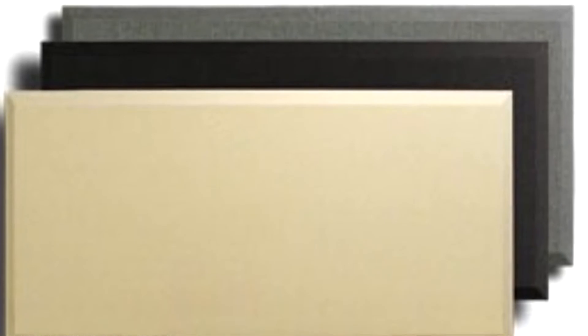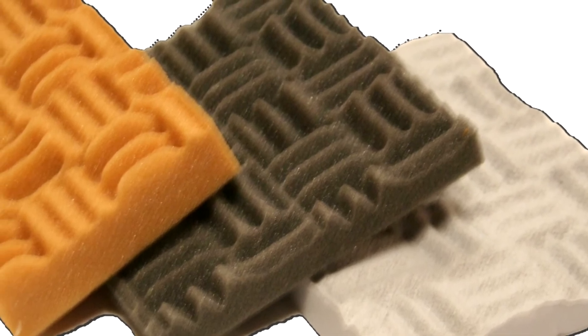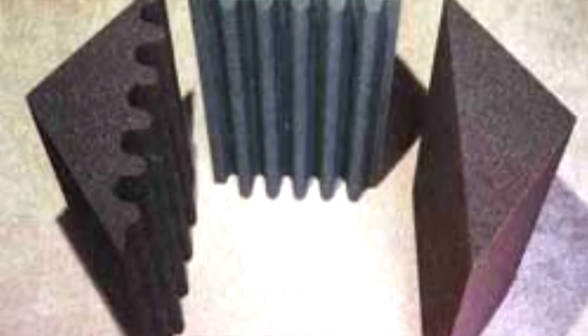For these types of treatments, one inch and two inch acoustical fabric wrap wall panels are very nice, especially if you're going to be putting them up and taking them down. They're a little more durable than foam but offer the same absorption values across the board. Foam is also great — it's lightweight, fairly inexpensive per square foot, and comes in interesting colors and patterns. So one inch and two inch acoustical foam, one inch and two inch acoustical wall panels, and foam bass traps in the corners, along with alpha diffusers or barrel diffusers as well.